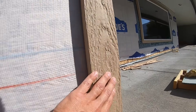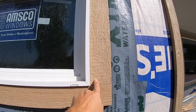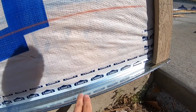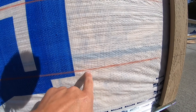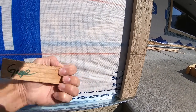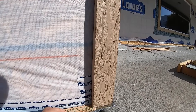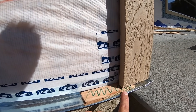Then you need to put on your corner piece trims which we have on the front end. Our corner board trims actually match the exact same as our window trims. Next we need to start running chalk lines — a chalk line off of this flashing up to eight and a quarter, which will be the top of our first piece of board. I have a gauge here, and it sits about three-eighths off of everything. So we strung a string line at eight and a half inches from our flashing up to this line.